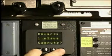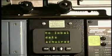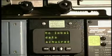At this point, the imbalance data read question screen will show. To calculate a one plane balance that will direct us to add weights to the fan rear spinner cone, push and release the no button two times — this causes the balance one plane compute question screen to show. Next, push and release the yes button — this causes the X flights display question screen to show. Note that X refers to the total number of flights or trim balance runs in memory and could be one through six. If the no imbalance data shows, that tells us that there is insufficient balance data in the AVM and that a ground run will be required to gather this data.